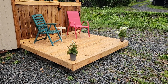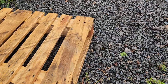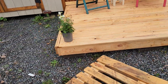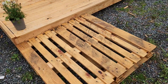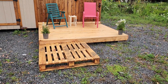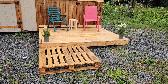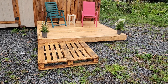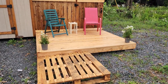You could go a little bigger. If you wanted to expand this deck, add two more pallets to the front. I'll show you — there's a pallet here just laying on the ground. If I wanted to add on, I'd get two more pallets, get them leveled up on patio stones to the same level, and there you go — that's another four-foot section added on. You'd need eight deck boards for four feet because they're six-inch boards. Eight boards at five bucks a piece — that's 40 bucks.